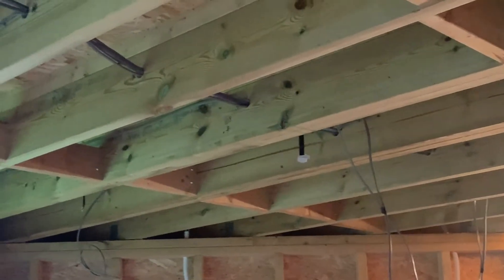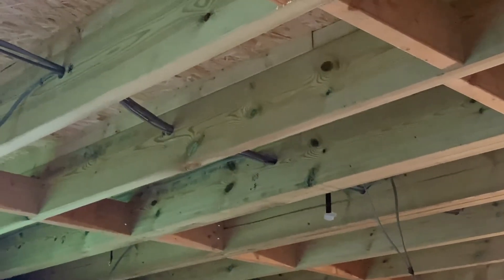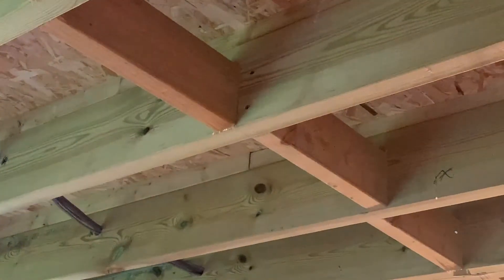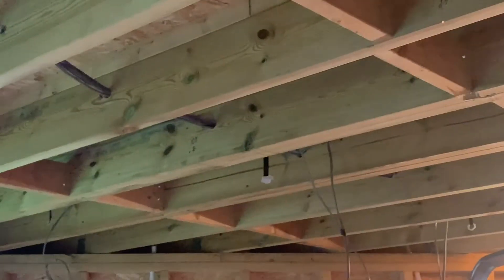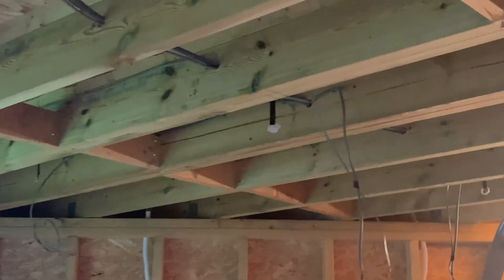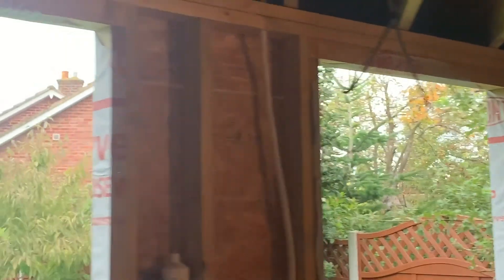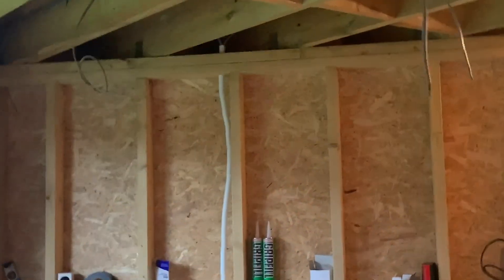So that's my cold roof design. It's a very sturdy roof — I've been up there to put the rubber roof on and fit all the soffits and fascias, and it's very, very sturdy. Next job: I've just done the first-fix wiring, so next I'm going to batten the outside and put the cladding on the back and the sides, and then I can get on with the PIR insulation on the inside. Thanks very much — please click like and subscribe and I'll keep you updated.